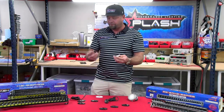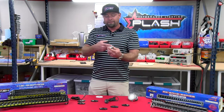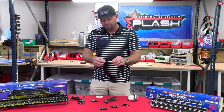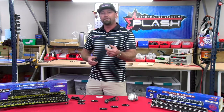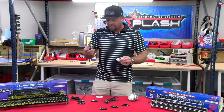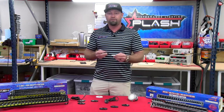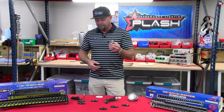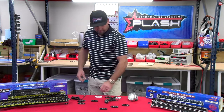When you compare this forged carbon fiber housing to this — which is actually a cast aluminum housing on a workboat — the dissimilar metals, you can see the coating is hard to get in there. You've got exposed aluminum, dissimilar metal, corrosion. Then you add in the saltwater elements, and this thing will crumble. It can last just a couple months on a workboat if somebody doesn't care about cleaning it. The carbon fiber, though, is going to last until the LEDs go out. If it doesn't last 40,000 hours, I'd be shocked. Really happy to bring this first product of our carbon fiber division onto the market, and hopefully we'll have plenty of other carbon fiber lights to follow.